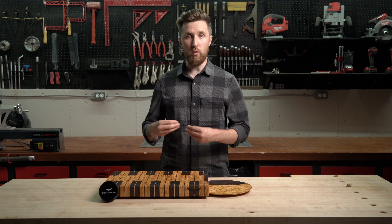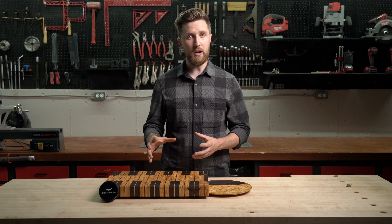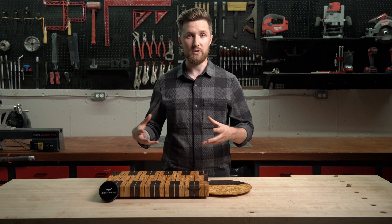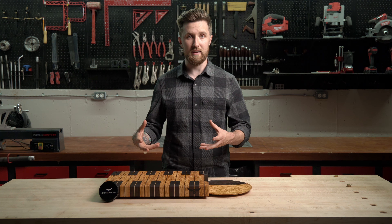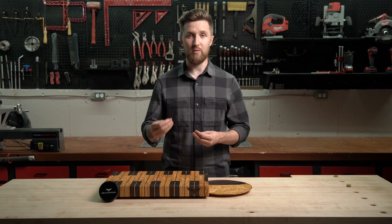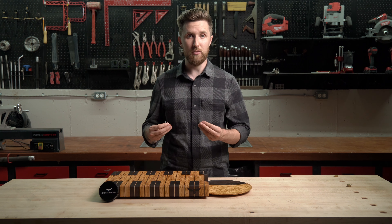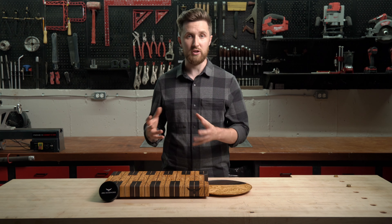The goal is to minimize the amount of water or moisture that can get into your cutting board. When oil goes into the wood, it swells and holds the oil there indefinitely. Water, however, will also go into the wood and cause it to swell. But water will then evaporate at a rate the wood cannot keep up with — the board will try to shrink, won't be able to, and all that tension is going to cause it to crack.